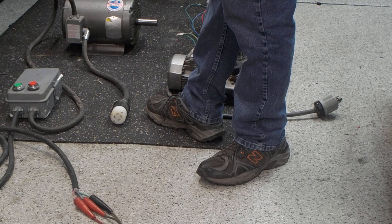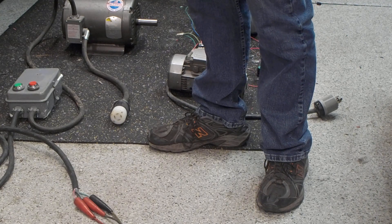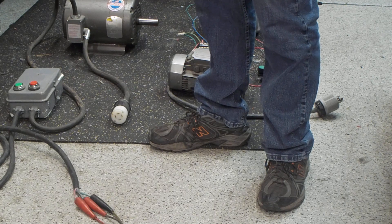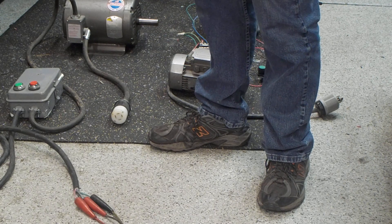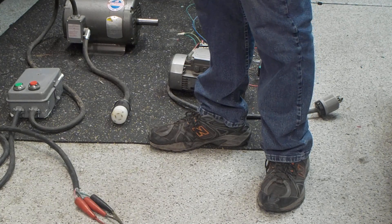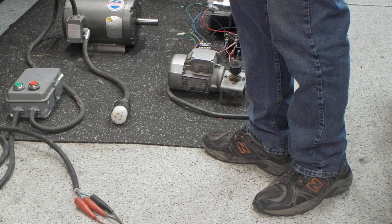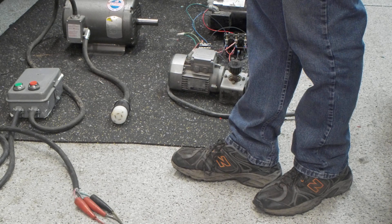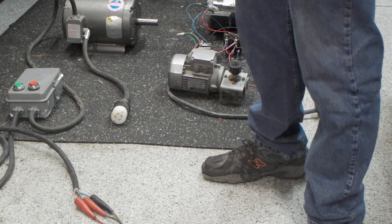What is nice about it is this will not restart until an operator tells it to. It won't restart on its own if there's a power outage — that's a safety feature. And that's probably enough for this video. We'll explain the hookup of the other mess here on another one. But this is for you, Mike. Aloha.